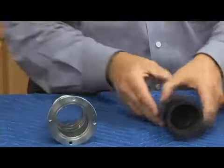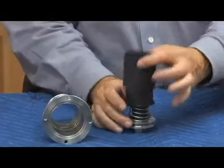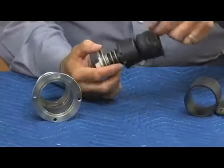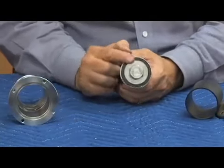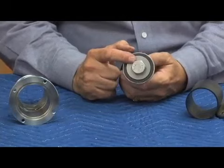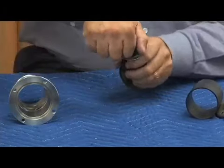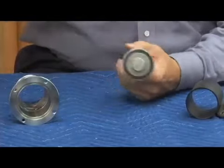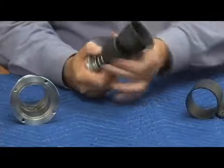I have my relief valve body, my stem assembly, which has a rolling diaphragm support, my rolling diaphragm, which is glued to my rolling diaphragm retainer. I have a large 15/16 stainless steel nut. So what do I need, a full impact wrench to remove that? No, it should only be hand tight. So if it's hand tight again, we know that there should be an O-ring seal underneath. So go ahead and unscrew this.